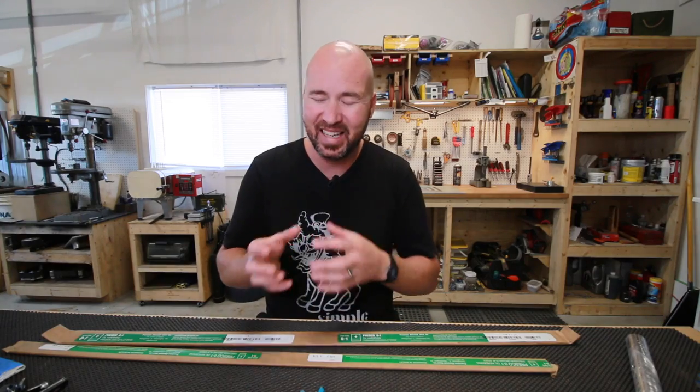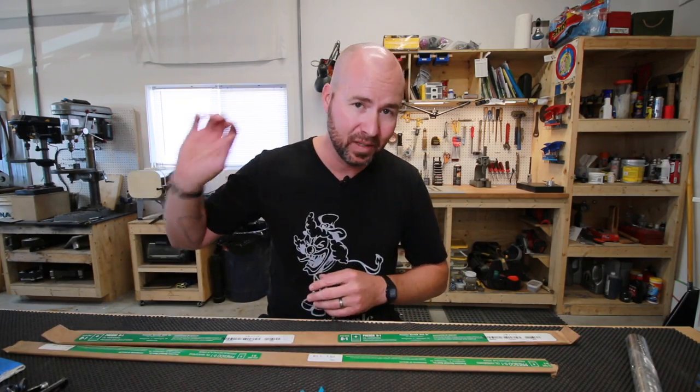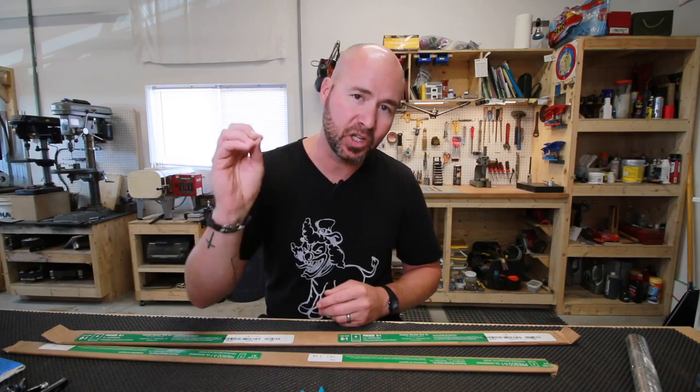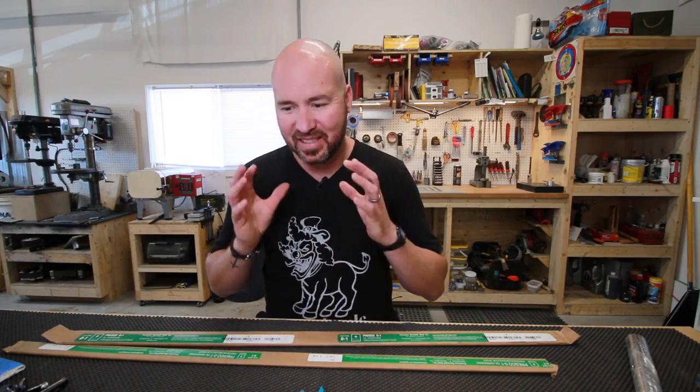Now, I have also seen some knife makers that I really do respect not do foil wraps at all. And I guess the question is, how much decarburization is happening, right? I can't measure that. We could get scientists involved and measure that stuff. But my thought process behind it is that maybe it's fine. Maybe you really don't need a pouch. I think you do. I can't prove one way or another that you've lost X amount, this percentage of your carbon has been burnt up, 100% guaranteed. I can't do that.